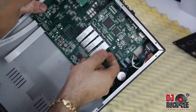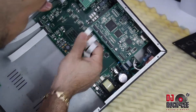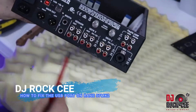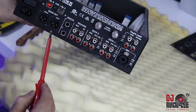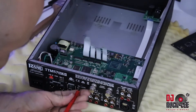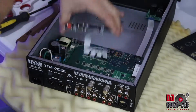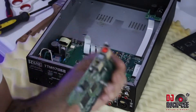The very next step is to remove all these ribbons from the USB assembly. There are two screws in the back that hold the USB assembly. You want to carefully remove these screws, and you'll be left with your USB assembly.